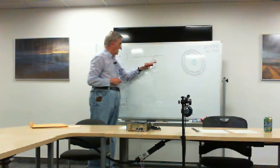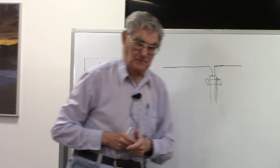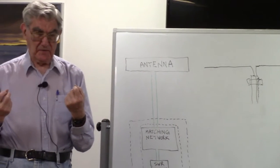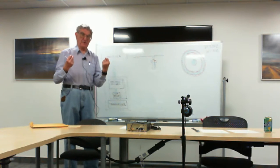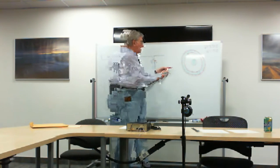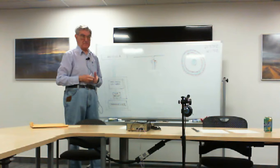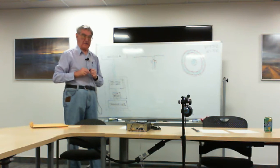The nature of the coaxial cable itself will not allow imbalanced currents to flow on the inside. What that means is that it forces these antenna currents that want to be unbalanced to be balanced. There will be a loss of efficiency because of this effect, but what it will do is prevent the radiation from a current flowing near the outside surface of the coax. This is a very, very common problem, actually, and I'm afraid most people don't understand it. And that's how it can happen and does happen.